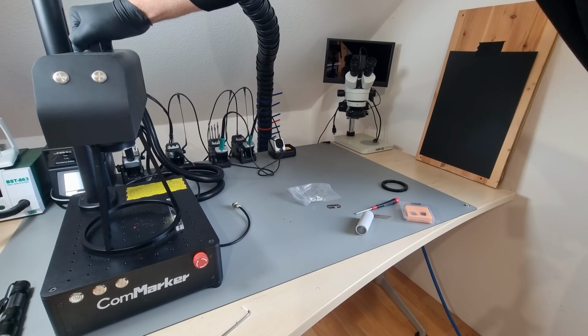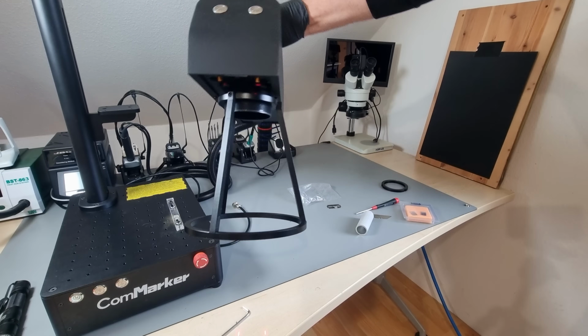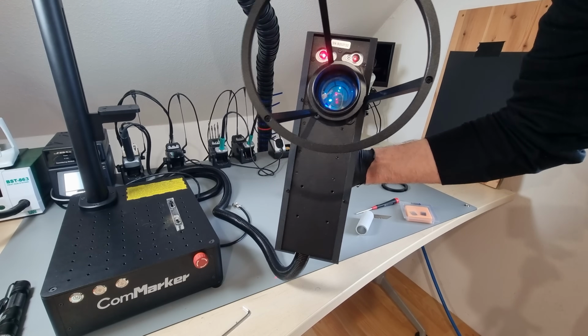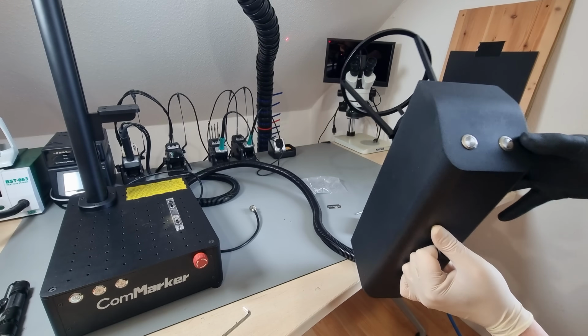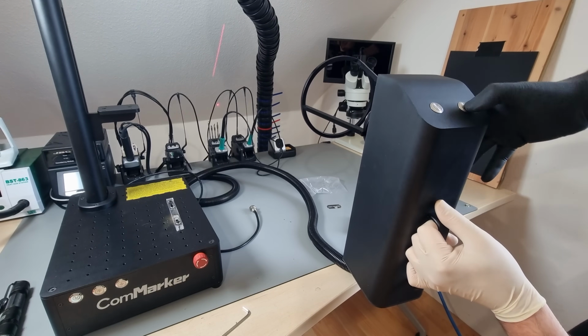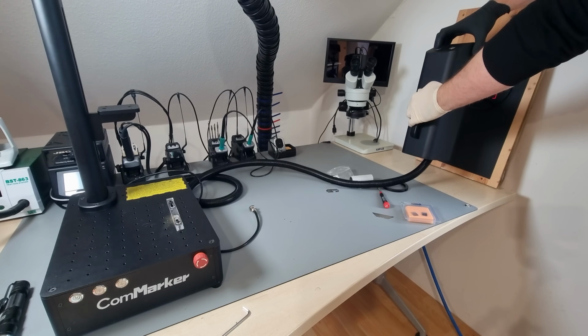If it wants to be taken seriously as a professional, productive, lucrative tool, I think it has to do more to comply with Class 4 laser safety regulations. An interlock input connector or two would be good, for example, if a user wants to build their own enclosure. And for this remote handheld mode, I need kind of an output active indicator, so that I know 100% when I can move again. And a stop button please, because if I change my mind in the middle of an operation, I might not be in a position where I can reach the base.